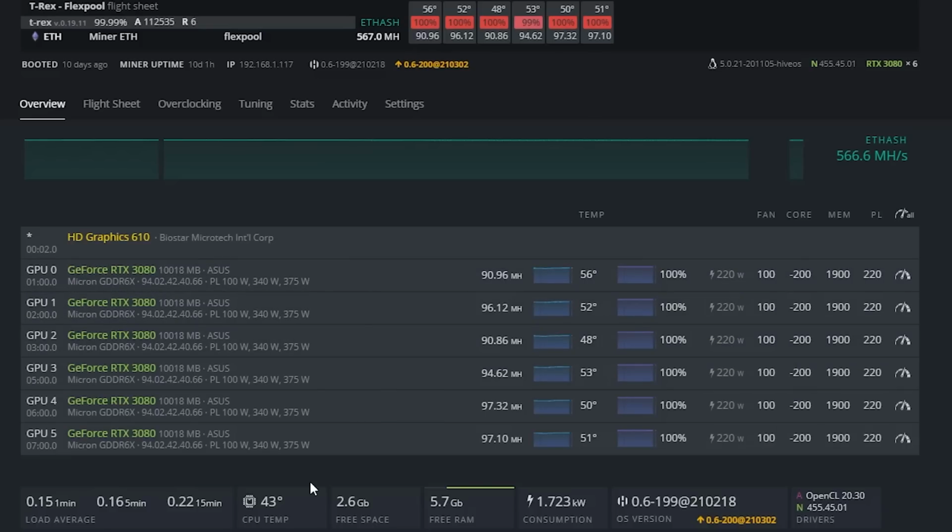So I might be changing the thermal pads if getting another fan and blowing it near them won't fix the situation. If you're having the same issue, don't worry, you're not alone. It's basically almost all RTX 3080s and 3090s. Just make sure that you provide enough cooling for them. If not, then you can try to replace your thermal pads or add new thermal pads to your GPU.